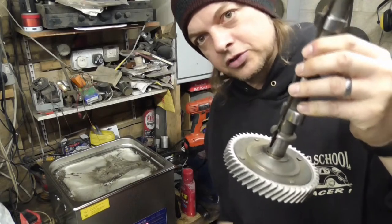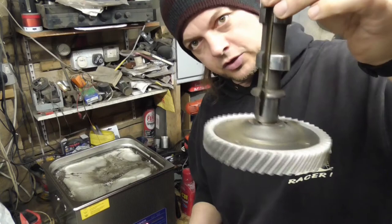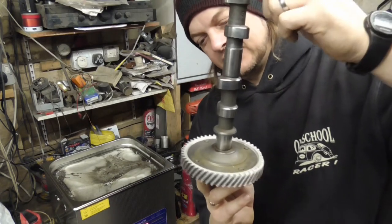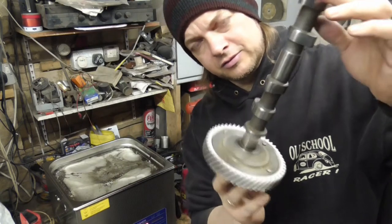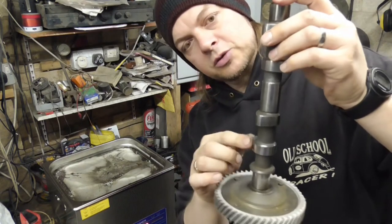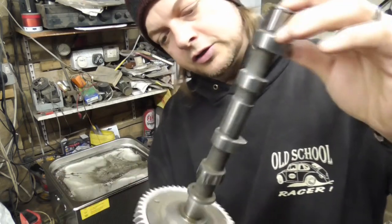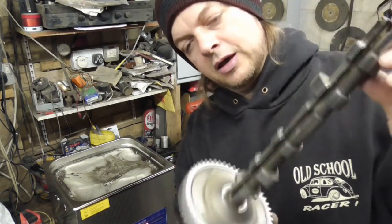I actually pushed the boat out a bit — I've treated myself to an ultrasonic cleaner. I was a bit disappointed by how well it worked on this piece I was trying to clean for the lamp. So I filled it full of citric acid and it's worked very, very well on the bottom — it's actually eaten loads of the metal away, and that took only 30 minutes at 50 degrees. Be careful if you're going to acid and ultrasonically attack something like this. It did dull the lobes quite a bit as well, so I've got the polishing wheel on it — just the old polisher — and it's come up reasonably well. All I need to do now is find some clear coat, give it a blast so hopefully it stays like that, and we can start constructing it.